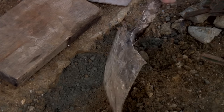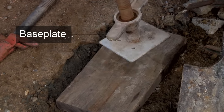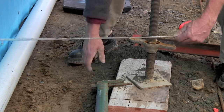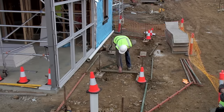This often means that the ground underneath them needs to be excavated. Use the base plate to compact down the sole plate. Now you need to check that the position of the sole plates and the base plates are correct. Careful preparation at this stage means a good foundation for the scaffold.